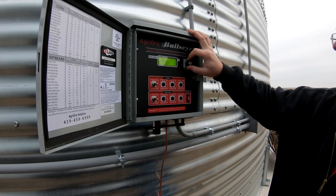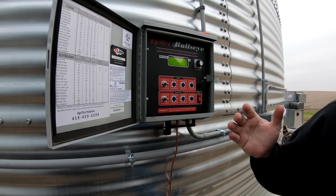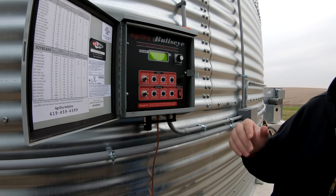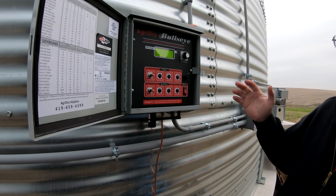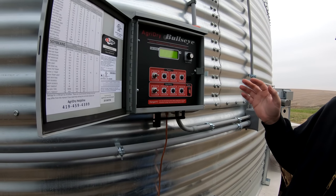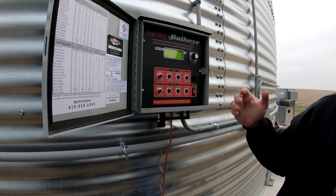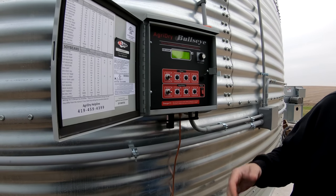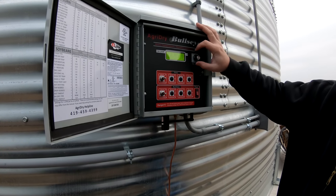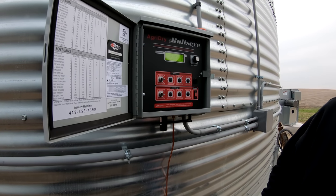Minimum air temperature — this is where, if you're going to want to freeze the grain, I think you said you're a little drier than what you'd like to be. But if you get to the point where you think you're going to have moisture in the bin and you're unsure it's going to keep, you're going to want to change that minimum air temperature down to like 30, and then it'll allow it to run to the point where it'll freeze the grain if you need to.